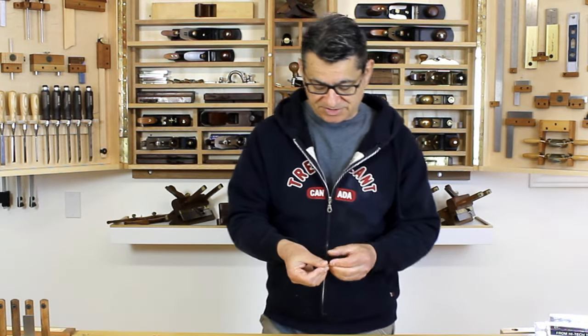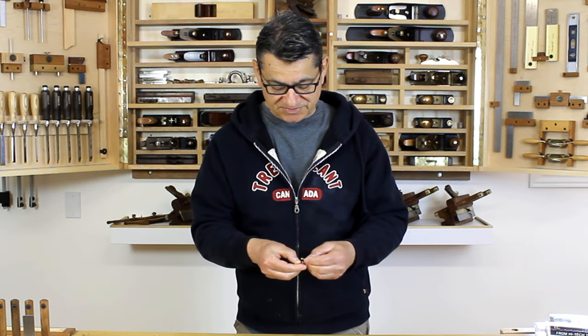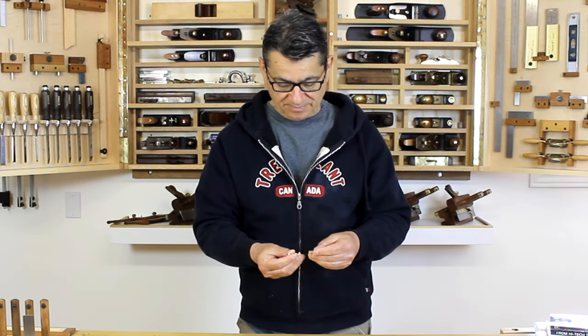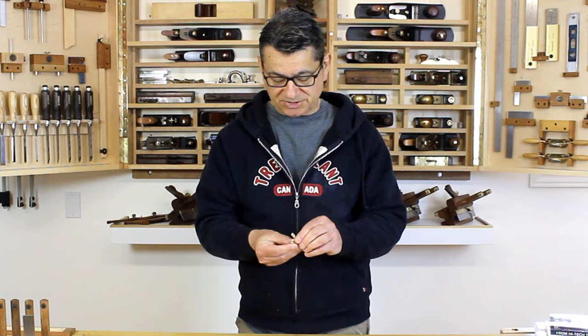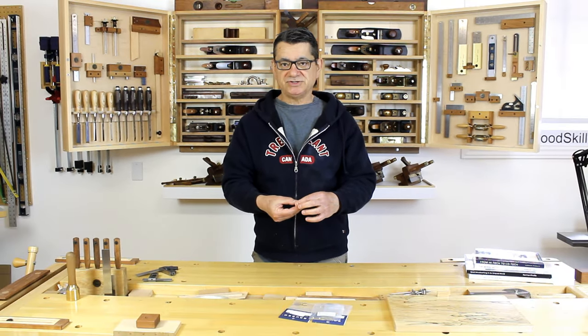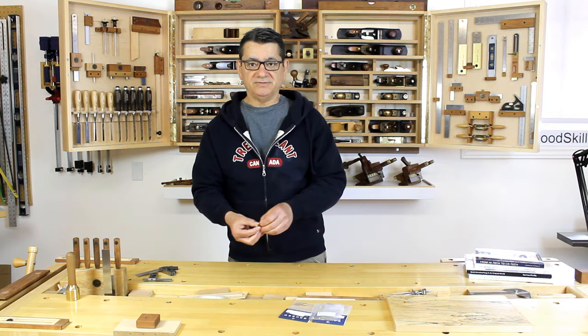These consist of two leaves. One leaf has a pin in it, and this would reside in the top and bottom portions of the cabinet — the top and bottom panel — and this would reside in the actual door. The pin itself is steel and this rotates around. With straight hinges, they're really designed for overlay doors, and I'll give an example of that.